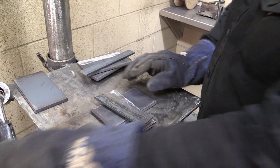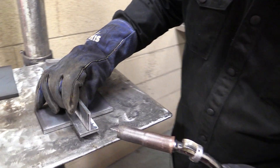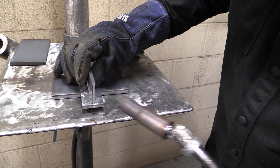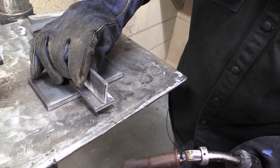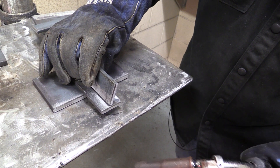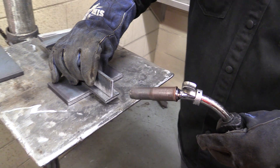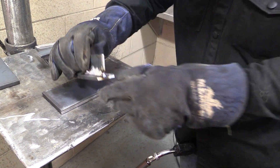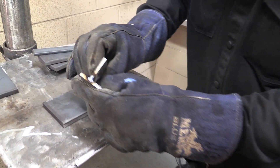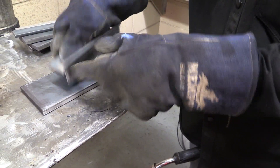So what I'm going to do is bring these in. I have my MIG gun ready. I'm going to set it up in the middle, make a nice T-joint, and I'm going to tack it right on the end here. Now if I tack it from one side or the other, whichever side I tack it on is going to pull this thing that way — so I want to tack it right on the end. I have a nice little tack right on the end and you can see it's still pretty much 90 degrees.